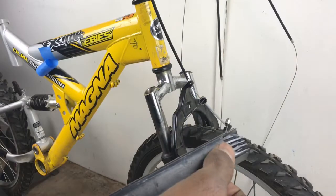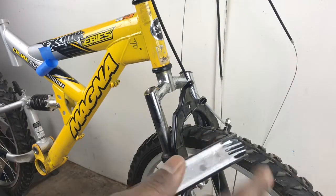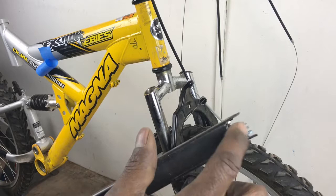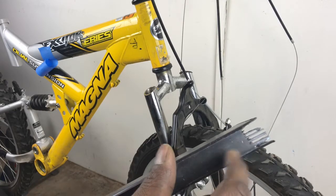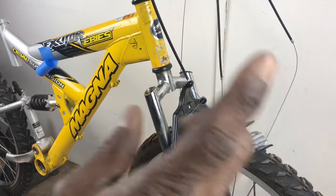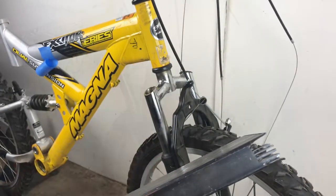I used a similar technique on cutting out the metal. I went too far right here so I made a mistake, but basically cutting these grooves out allows me to get a curved shape. I'm going to come back in with a die grinder and clean it up, pop these little pieces off, get it cleaned out, and then start trying to fit it up to my pipe.